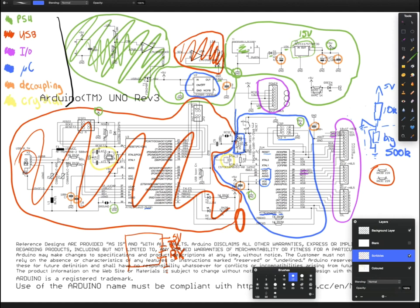The data sheet that you want to look at, and I'm running out of space here, is the AVR910. So if you Google that, it should tell you a lot more information about this connector. So basically, the pins we need to connect are the same pins as what's known as the SPI interface, which is these 4 guys here.